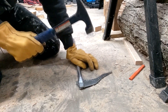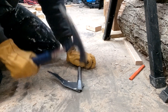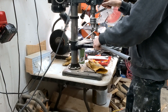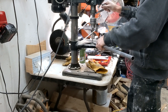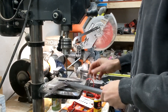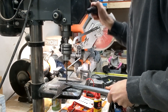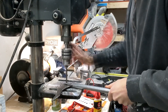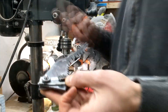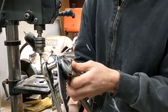I then pounded, very delicately and very precisely, the steel so that it would lay flat against the pick so that I could screw it in. I took it over to the drill press and drilled two holes on a linear line down the center of my tubing. This stainless steel screw fits great. I then drilled the second hole very precisely, because this would set the angle at which the pick will sit forever. I then used a locking washer, a regular washer, and some locking nuts. Then it was time to send this baby home.